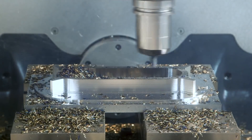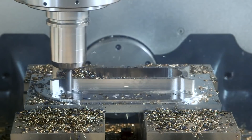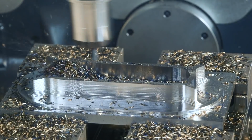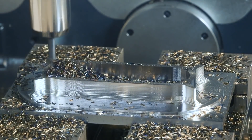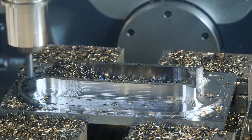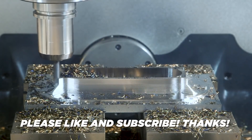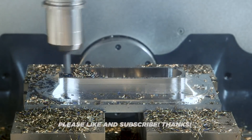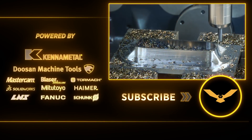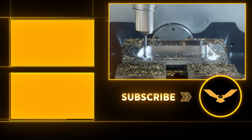One thing I'll also say is that all your machinists basically can't just run the way they want to run. Because you have everything documented — the tool documented, the time in cut documented, the speeds and feeds documented for each type of material. You find out what is best, you document it, you bank it, and then the whole team works off that. And if somebody wants to challenge it, you let them challenge it. You got something better? Show me. If not, this is the way that we're doing it.